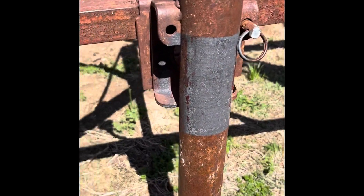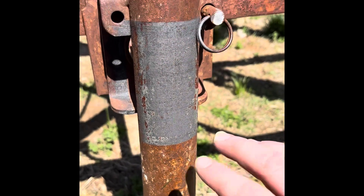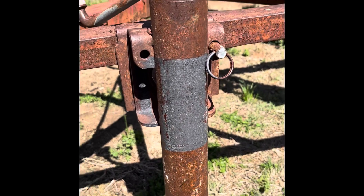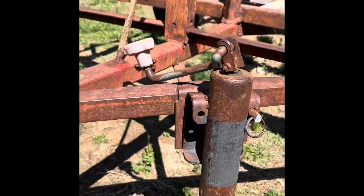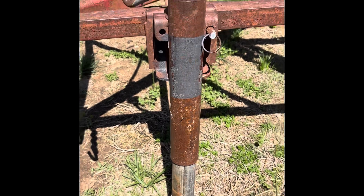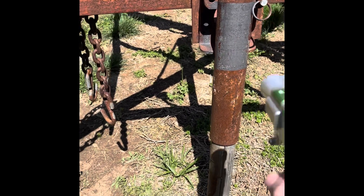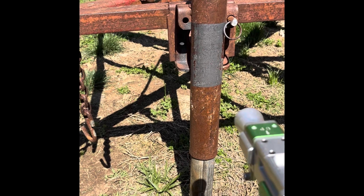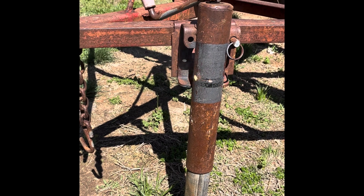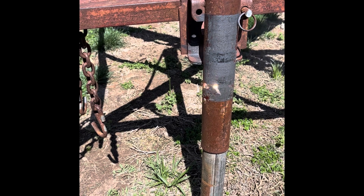That's actually giving us a pretty nice clean to start with. I might bump that power down just a little bit, but we'll leave it for now - this is just a utility trailer, just going to be used to haul my mower around, so I just need it to not be rusty. The focal distance here is roughly 16 to 17 inches, I think. The way you'll find if you're cleaning at the right distance: if you've got high power settings but you're not cleaning and you're way up here, you're not going to be anywhere near your focal length. As you come back closer, it'll get brighter and you can hear it get louder. And if you keep going past, you'll hear it start to get quieter. Where it's the brightest and the loudest - that's where you want to be cleaning, because that's where you're getting maximum efficiency out of your gun.